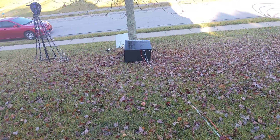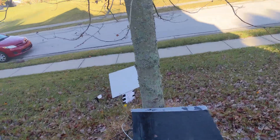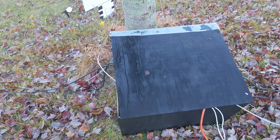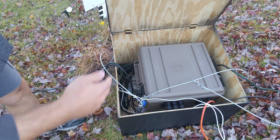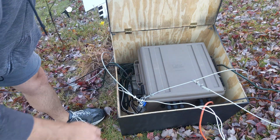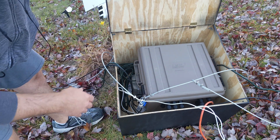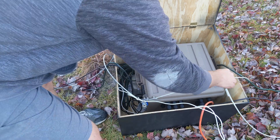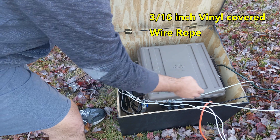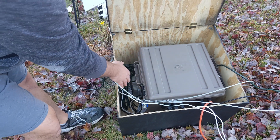Now let's cover how it all connects outside. We start off with the center of the yard and the box that contains the networking data and the power. The power and data come from the house on a line that goes into the box, where we have a switch that splits out the networking data to the different sets of props in the yard. We have a security wire hooked around the tree to secure the box in place with a lock, and a GFCI power switch on the left-hand side that drives power to each side.